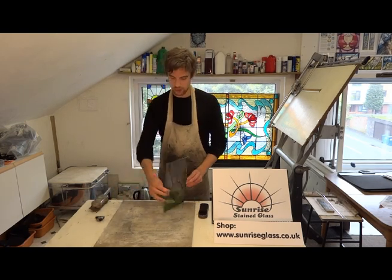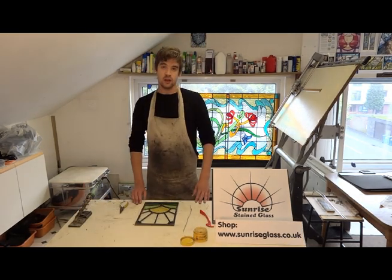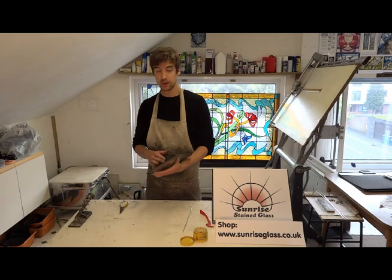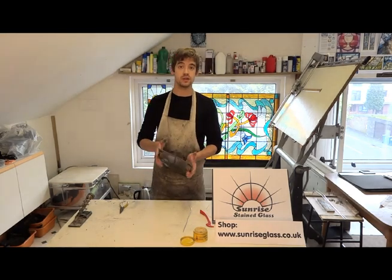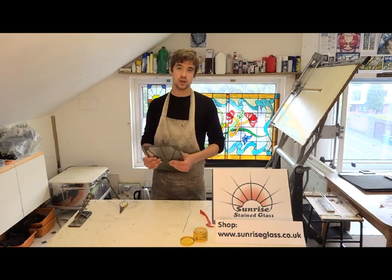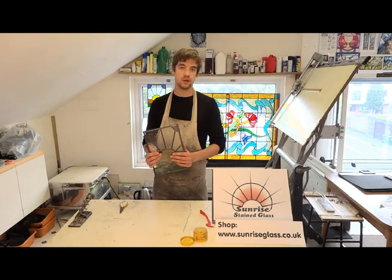And there we have our window cleaned on one side. You have to repeat that whole process on the back. Now I've finished giving the window a thorough clean and it's looking pretty good. In most cases when we're making a window, that would be the final stage, it would now be complete. The only thing we may need to do might be to add some copper ties, so strengthening bars could be attached to the window when it's fitted. A window of this size wouldn't need it.